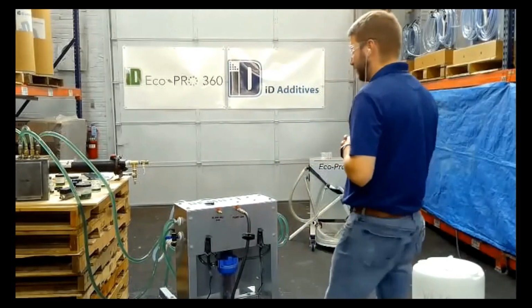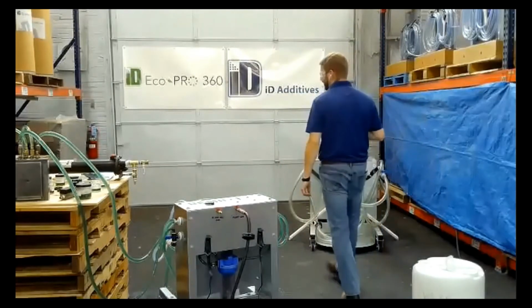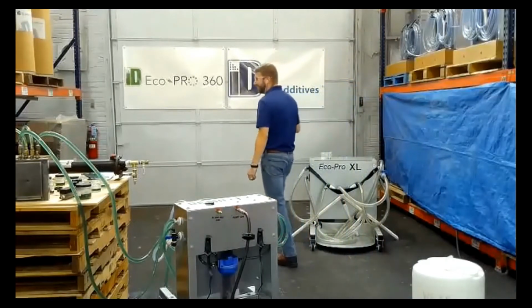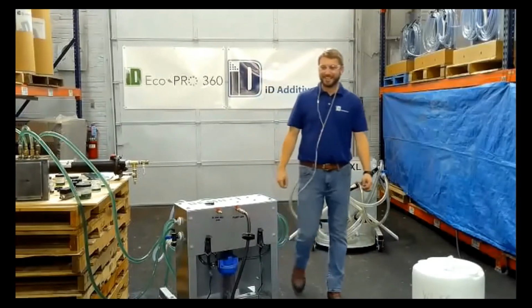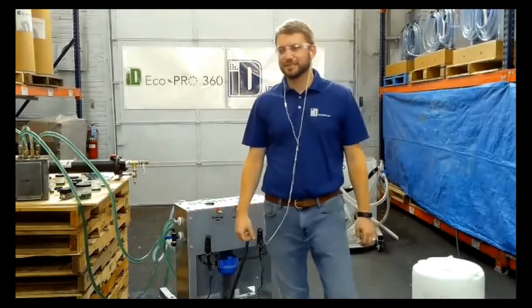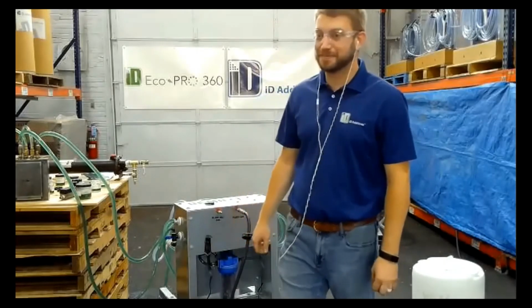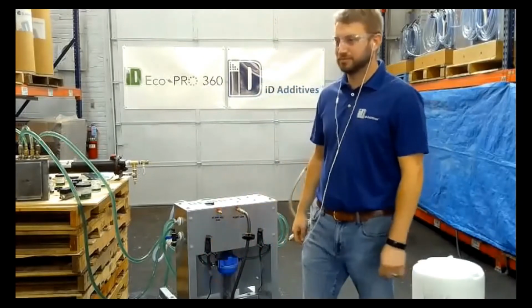That was the number. Yeah, I didn't want to overstep because in my head I was like, man, that seems way too high. But I know, people don't believe that. A 32nd of an inch of funk in a line reduces the cooling capacity by 60%. That's crazy, but that's why cooling is so important, and that's also why it's such a neglected area of maintenance.